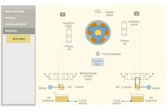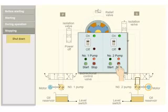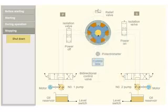The steering gear system is shut down when the ship reaches a port and berth alongside the jetty. The steering pump motor is switched off. The control power supply at the bridge is switched off. Click the steps in each procedure to view details.